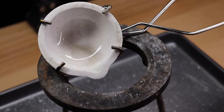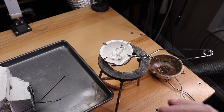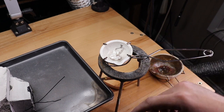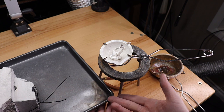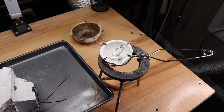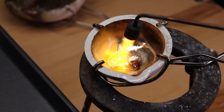Before doing any casting, make sure you're on a surface you don't care about getting burns on. Make sure you have a non-burnable surface to hold your stone in case you spill, and make sure it has edges so the metal can flow and be contained. Make sure you have dark glasses to protect your eyes because it gets pretty bright. Ventilation is very important — make sure you're well ventilated or do this outside. If you're using scrap metals, cut them up as small as possible so they have the most surface area and melt down fastest, similar to how shot works.